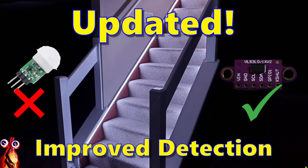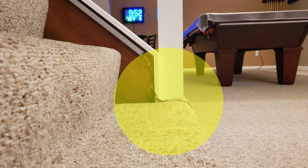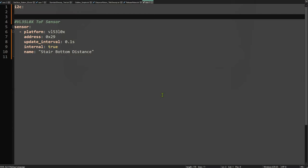In another use case, I replaced a PIR motion detector with the VL53L0X time-of-flight sensor to create better binary triggers for controlling my LED stair lighting. The original PIR sensor had a wide field of view and long range — even with fins or tubes to block some of it, walking near the stairs could still trigger the lights. Using the VL53L0X, I first narrowed the field of view significantly, then used distance to create a trigger threshold — essentially a break beam across a step — so the lights only trigger when you step within 30 inches of the sensor.